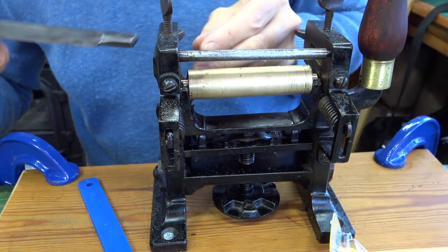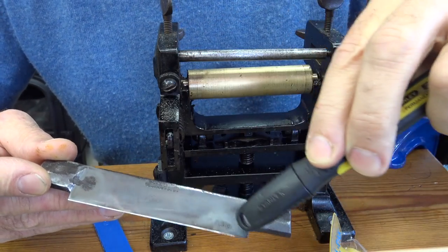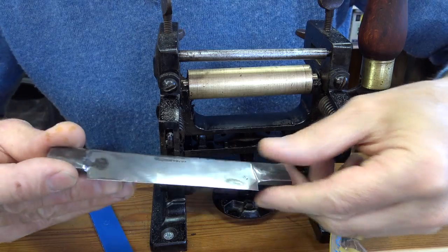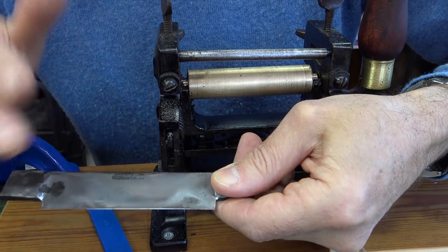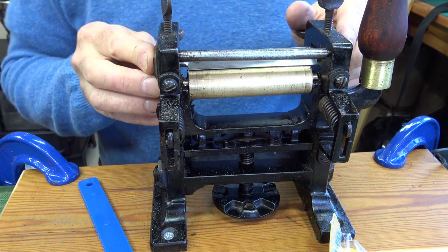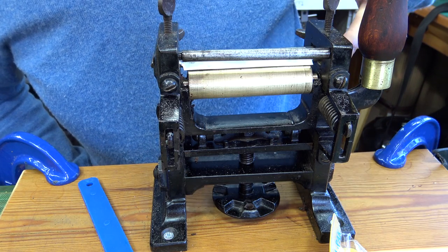With high-quality woodworking tools you will get a good cutting edge. A little tip: some people put a felt-tip pen line along the cutting edge, then rub it until it's gone consistently — that way you can see where it's uneven. It's not perfect even after all that sharpening, but it's pretty good. With old machines you may also have to slightly level up the blade in the machine itself — I have a tiny brass shim under the blade at one end just to get the blade-to-roller distance consistent.